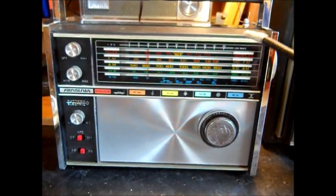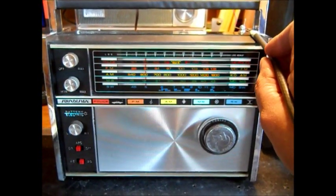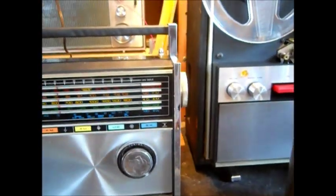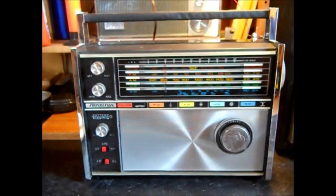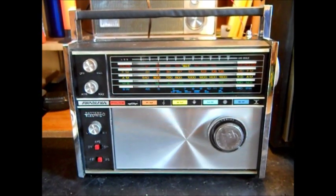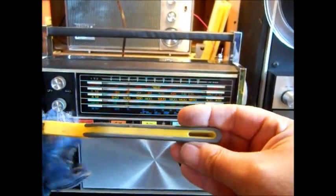You ground to a ground stake to the earth. I know people use any radio and ground the outside, but of course you're going to bring in a lot of other garbage too, so it's nice to have an RF gain on a radio. But that's that for this little project. It's a simple antenna to make — you can do any variations. I figured I'd give everybody that's never done it just a basic idea. I like the pill bottle idea where I can seal it in there and put that hook in — it made it really handy how I hooked it over to the tower. I wouldn't use wood for an insulator — it gets wet. Use some kind of plastic. Thanks for watching.